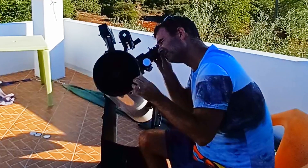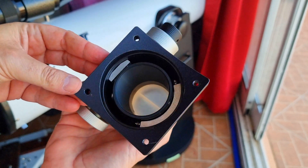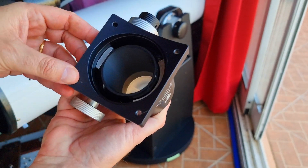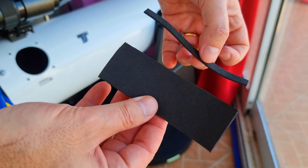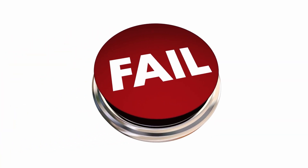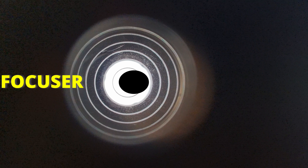This was the harder part. Now just make tiny adjustments until you have everything fine. However, if the secondary mirror is not centered in the focuser after this process, you may have tilt in the focuser. Sometimes it happens — it happened to me with my 8-inch Dobsonian telescope, and I solved it by taking out the focuser and using a piece of foam as a shim. Be careful and make sure it is really a focuser tilt, and not just centering the secondary mirror in the wrong way. In my images you can't see it because of the reflection, but there's a shadow which is not concentric — it's the secondary mirror shadow, and if you did the alignment well, it should be pointing towards the opposite side of the focuser.